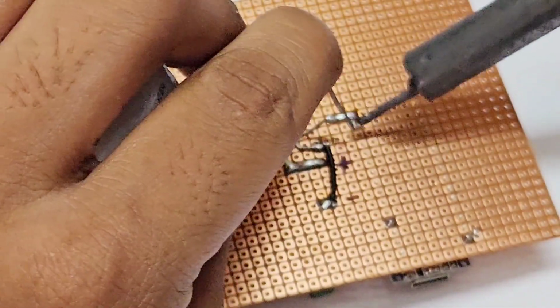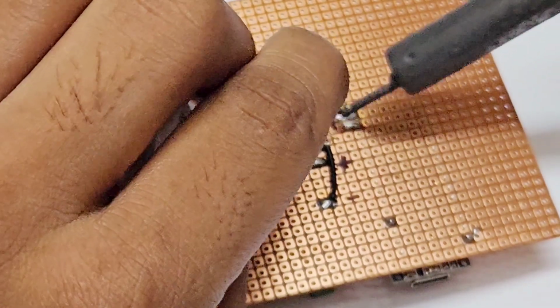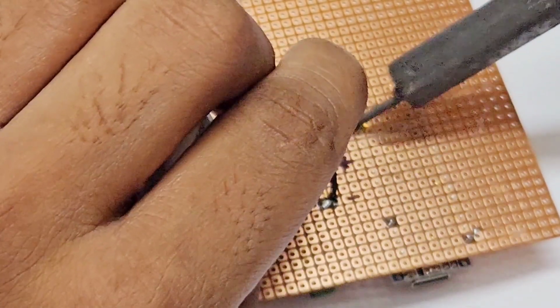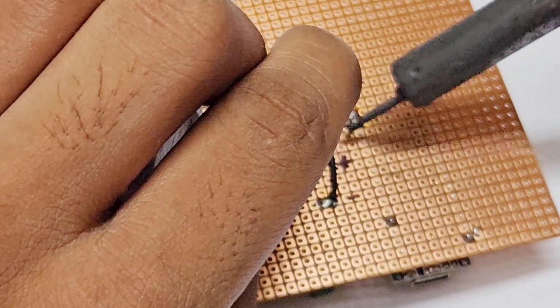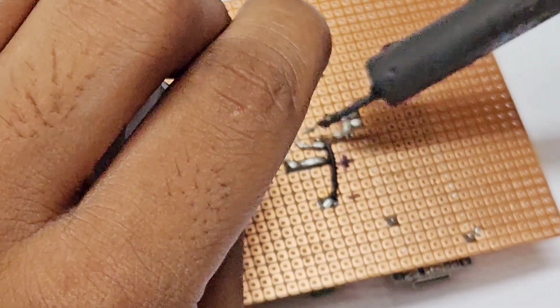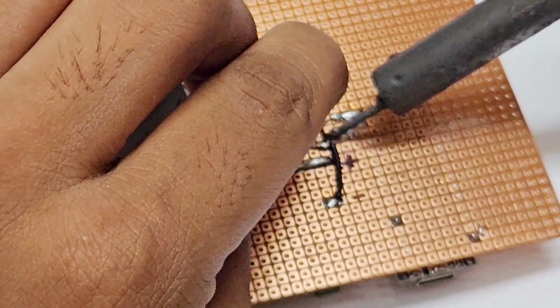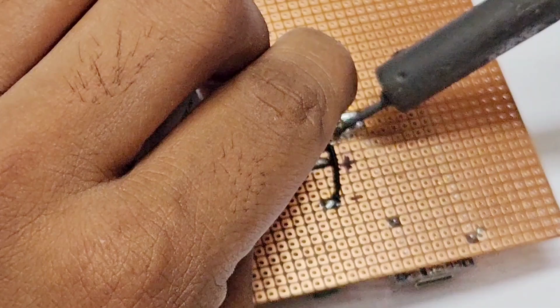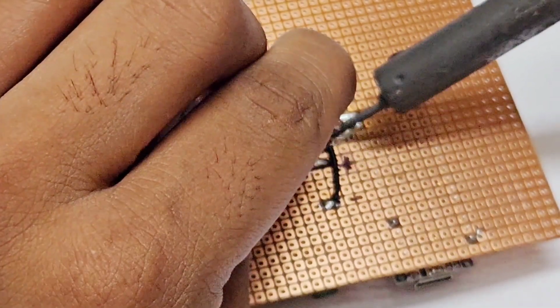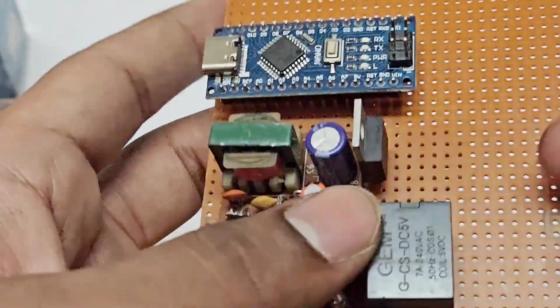So that's why I have to calibrate the IR remote first, and it's very simple. Firstly, we have to get any IR remote or phone that has an IR blaster. Then connect your Arduino with the serial monitor. After firing through an IR remote, you will get a hex code in the serial monitor, and you can just copy that hex code from the serial monitor and paste it to the conditions section of the program,